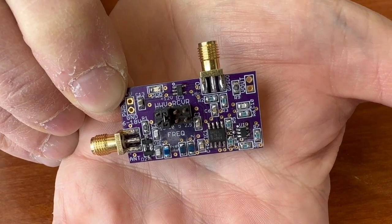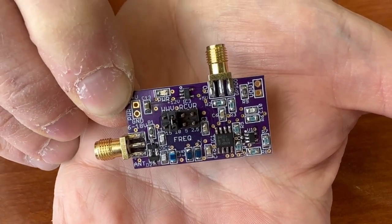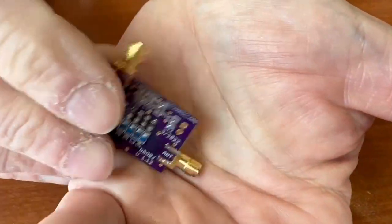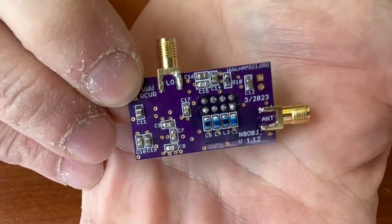I'm excited that today we are introducing a new version of the GRAPE radio, which I originally released in April of 2019, that has all the improvements I've generated for the GRAPE 2 that's going to be coming out. The board itself is essentially the same form factor — it's a rather small board — and this radio is now capable of receiving WWV 2.5, 5, 10, and 15 megahertz bands for analysis in our data collection.